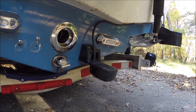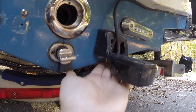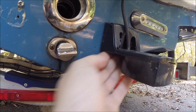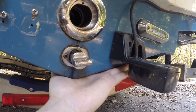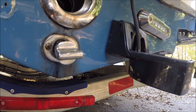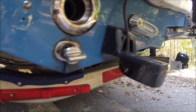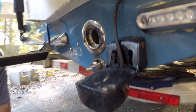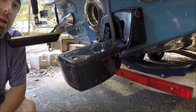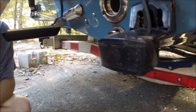Now this here is a TM150 — it's an inexpensive chirp transducer, again very low, not quite as low as the one here with the stainless steel mount bracket. This is a plastic kick-up. You can see the entire transducer is below the bottom of the hull. One thing you're going to notice right off the bat is the angle — it's a very low angle on this transducer. This one tends to do better with the big wedge installed so the following edge is very low.